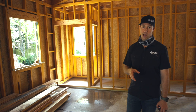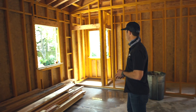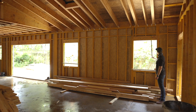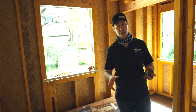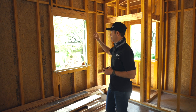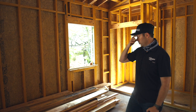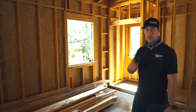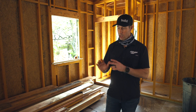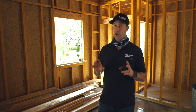Strength is the big reason builders have moved to LVLs for beams and headers — very stiff, a lot less movement than traditional lumber. These headers above the windows are a seven-and-a-quarter-inch two-ply beam. If we'd used a two-by-eight with a half-inch plywood spacer instead, I'd worry about differential movement and shrinkage. With LVL headers, builders have known for years that drywall corners won't crack, and that's what'll happen with these studs too — they really won't shrink and move. Also, when you sight down an LVL lumber pile, every board is perfect — it's an engineered, man-made material, so there's no cull, no boards to crown.